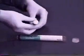The air repair sealant should be applied to a thickness of three-eighths inch (one centimeter). Smooth and taper the sealant. Do not extend the air repair sealant to an unprimed surface, as the sealant may separate from an unprimed surface. The air repair putty stick can be used to repair large gaps and crevices, or as a temporary plug if local air pressure cannot be released.